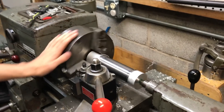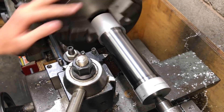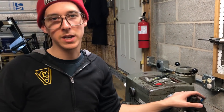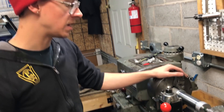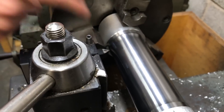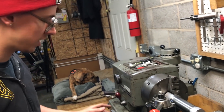Now I've created a way to support the tube so I can access the outside diameter with the turning tool — I can reduce the diameter or change the profile selectively. It spins pretty freely but it's held tightly. I haven't committed to a hard plan, but what I'm trying to do here is mostly cosmetic. I'm not gonna remove much material. The main thing is to lightly skim the diameter of the center section, bring the cutter in to get rid of the large radius, and replace it with about a 60-degree included angle that leads up to the larger diameters on the ends. Very slight diameter reduction — let's let it rip.